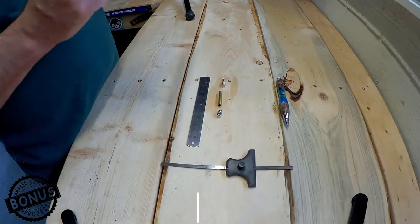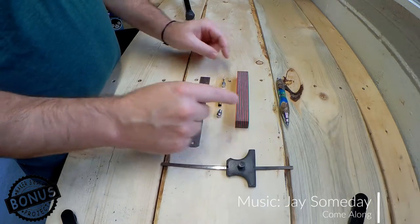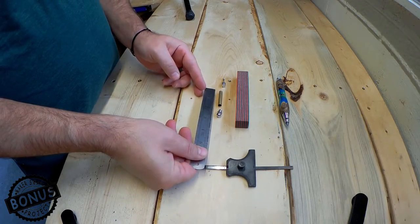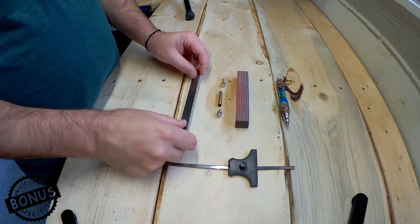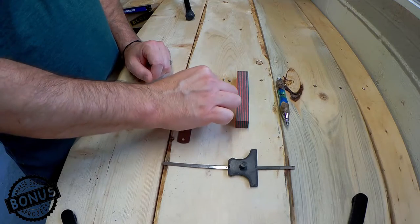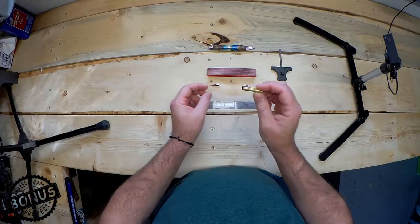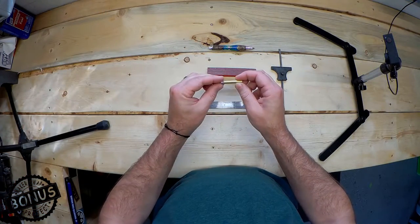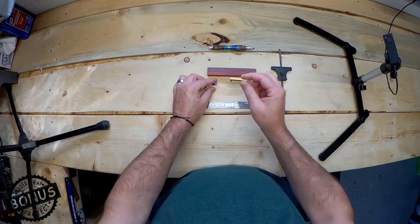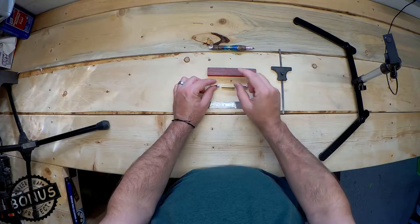Okay, we got a 5-inch Spectraply blank here and our ornament kit. The ornament kit tube is only about 1.5 inches long. I want an ornament bigger than that. I'm going to go about 3.5 inches. To fix that, you only need enough tube to press these into. So you only need less than 1/2 inch. If you cut this in half, you got more than enough tube for each side.